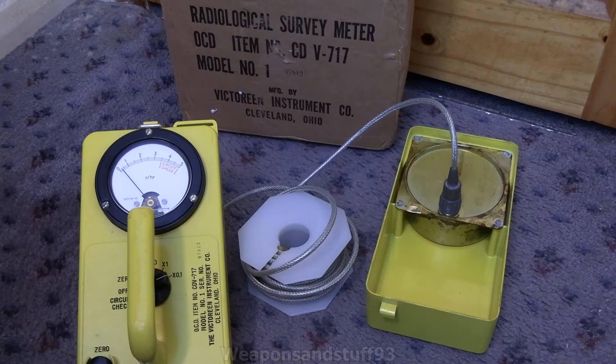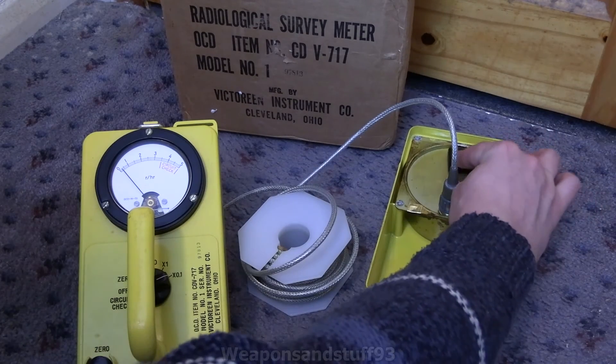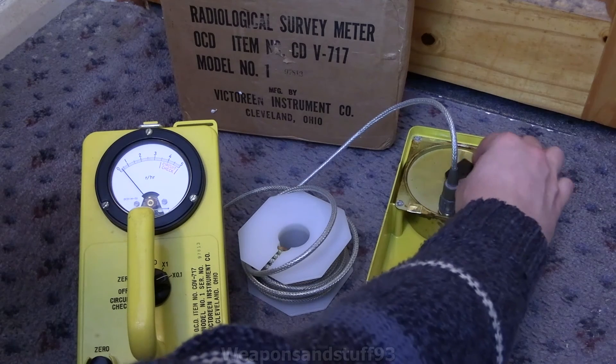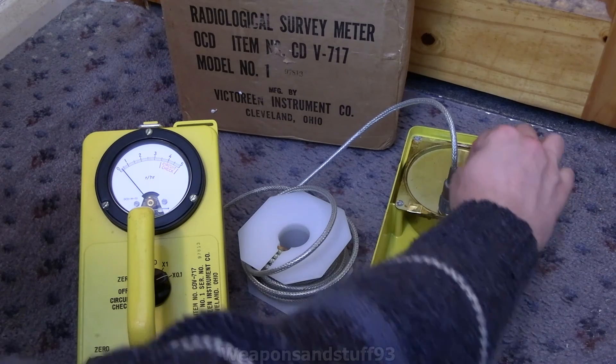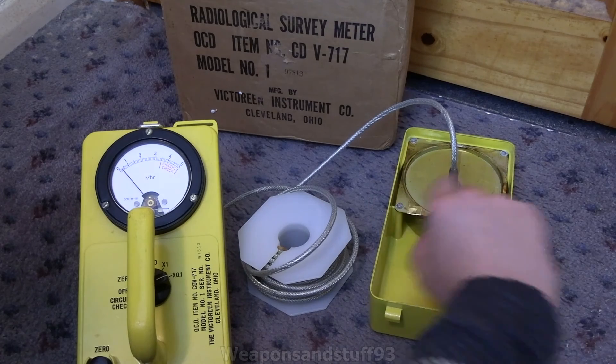If you're interested in what the inside of an ionization chamber generally looks like — there's the Polish D-08, which I can also test with the x-ray machine at some point. Its ionization chamber is open to the air — essentially you just have a gap between the positive and the negative current, and as the air gets ionized inside it helps form a circuit. There are very good science videos on YouTube if you want the proper explanation of ionization chambers. So with the DP2 source, despite how strong it is, it doesn't seem to do much to this unit.